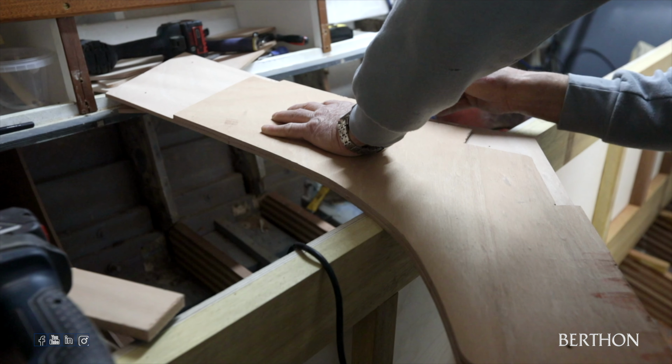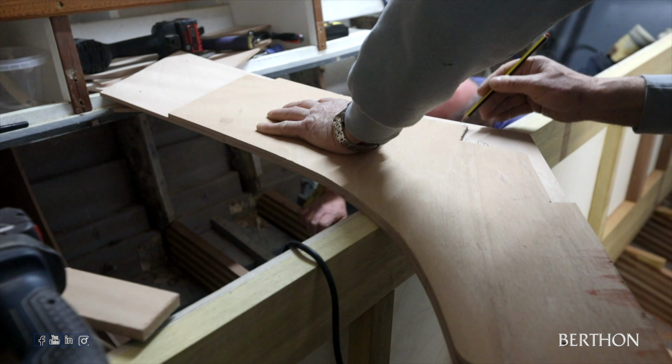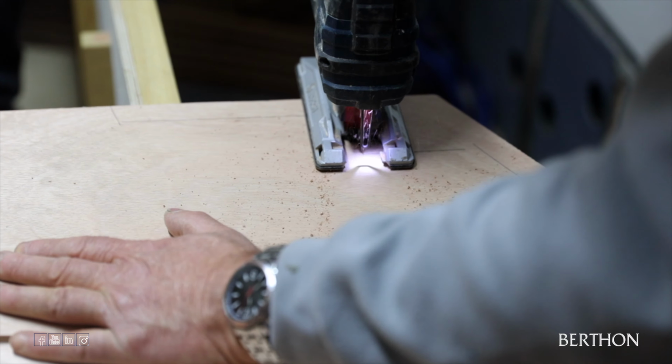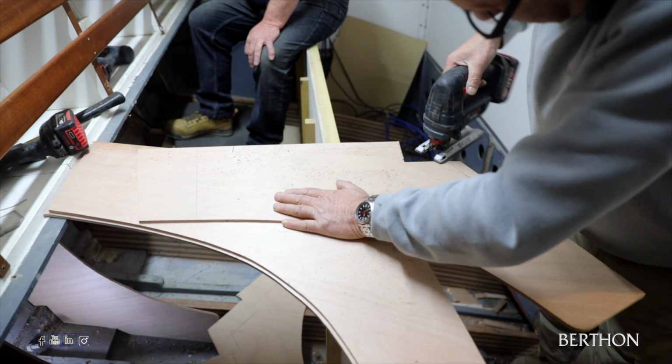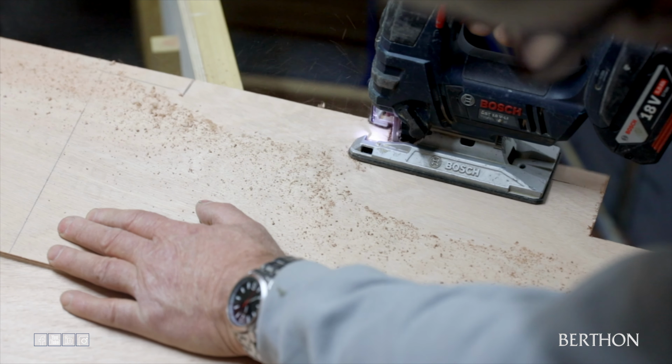With the box stringers, longitudinals and bunk fronts in place, it's ready to fit the bunk structure and webs, also known as knees. The use of the plywood webs or stiffeners is to lock everything together. Every corner or connection between two frames is reinforced with the web, which has been glued and screwed into each frame.